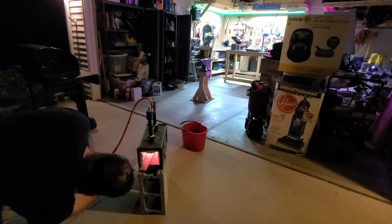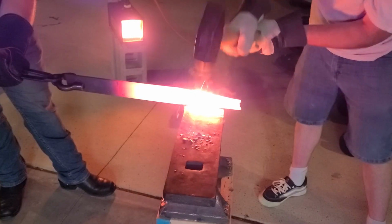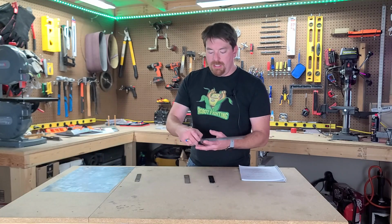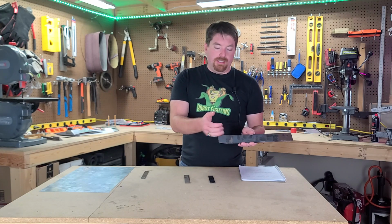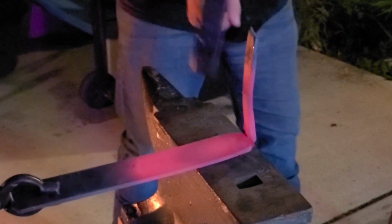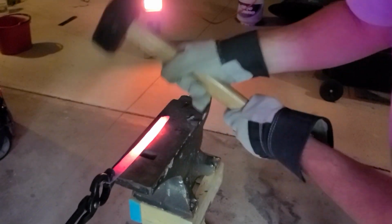First up, we had to heat the steel and continuously hammer on it. Now, 1095 is a pretty tough steel. It's pretty high carbon and can be really temperamental. But as we moved through the forging process, we just heated and hammered, and heated and hammered, until we got it down to a point at which we were able to place another piece of steel right in the area where we were going to break off the section we planned to use. We then heated it up to glowing, put the piece of steel there, and started hammering away. We did that a few times until we could break off the piece of steel that we wanted to use. As soon as we had that, we could continue to work the steel into a longer and thinner bar until it was right about where we needed it. Focus on that far side.